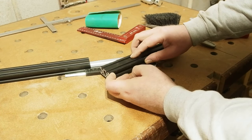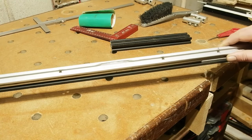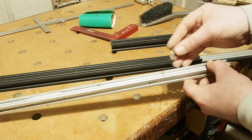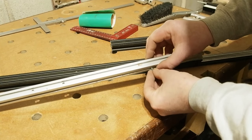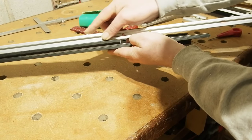Here I've got another of my gnarly lengths of 2020 profile leftovers — you might have seen me use a bunch of these in my profile build series. This one's got a bunch of holes in it already so it'll serve my purposes quite well. I drop a couple of M5 screws into it, which then in turn get one of these sliding T-nuts, then I slide it onto the fence.